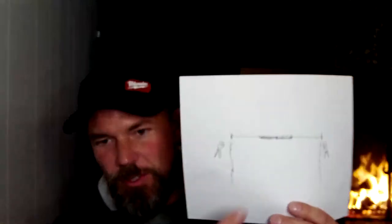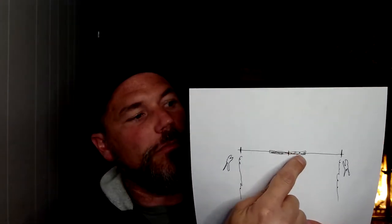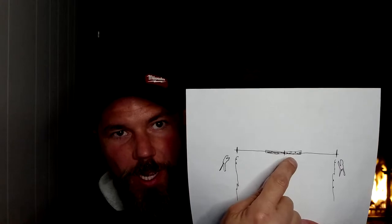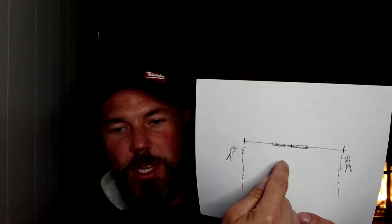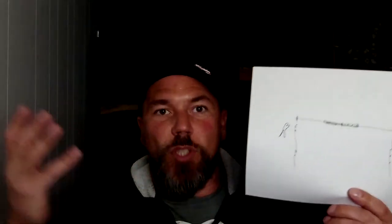And you got to get this under the door. So we got to get the weight of that door. What I like to do, if the winding bar is stuck in here and you have good set screws, is back wind this spring with winding bars. It's a little bit tough. What I do is I put some clamps, I use vice grips, on the cables. So as I'm back winding that spring, with my scale under the garage door, the weight will literally free fall.